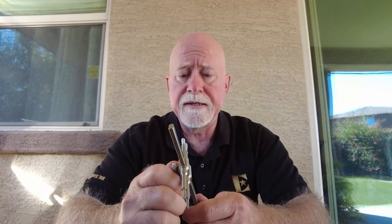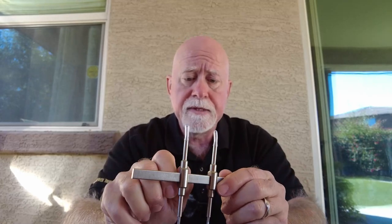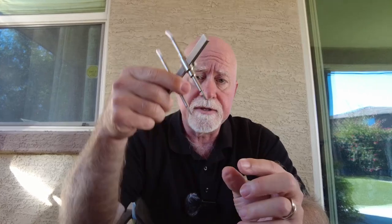This is the spanner wrench that comes from OPT. What's nice about this is that it's movable — you can move the legs so they'll fit whatever you want. What's also nice is that they have two types. There's a flat, like a screwdriver flat, so if your rings have slots you can put these into those slots and move them off. They also have points, so if you have holes — because some of these rings will have holes — you can use these point tips to go into those holes and twist that ring off.